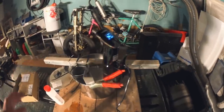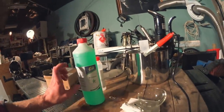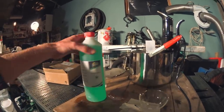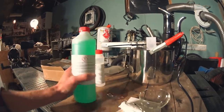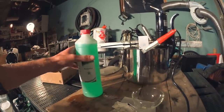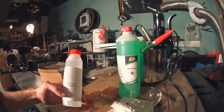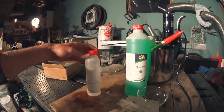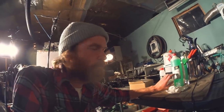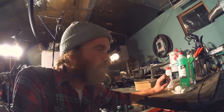The water bath is set up. I'm going to mix in 250 milliliters of this nickel star, which is just nickel salt. I think it's nickel sulfate in water. And then add in about 20 milliliters of this reducing agent. It is what makes this reaction happen without electricity. The nickel salt will be reduced to nickel metal on the surface of that iron piece.